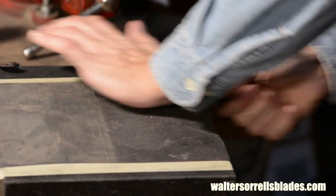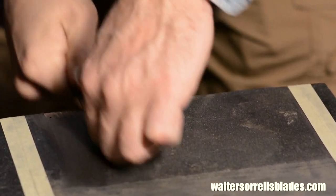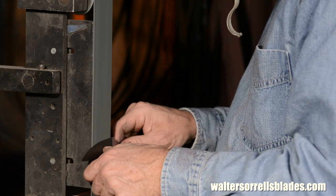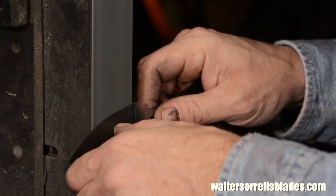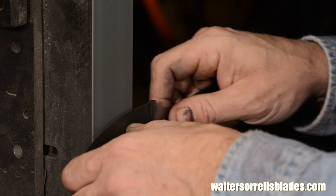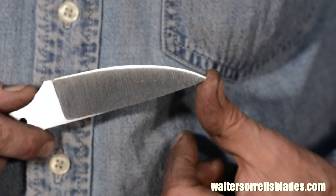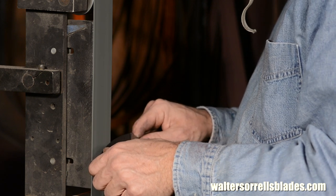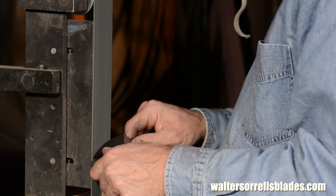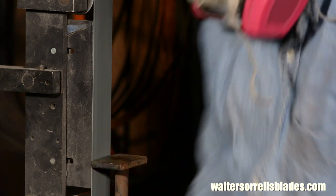So now I'll temper it for two one-hour cycles at 400 degrees. After heat treating, I'll clean up the tang with 320 grit sandpaper to remove the oxides that form on the steel during heat treating, then grind the edge to its final profile. Now be careful at this point — before heat treating you can get the blade so hot it turns blue, but after heat treating you'll ruin the temper of the blade if you let it overheat, and that'll make it so that the blade won't hold an edge. This blade is extremely thin, around six or seven thousandths of an inch, so the edge will just overheat in the blink of an eye. You've got to be very careful. I'm using 3M Trizac belts starting at 300 micron and working up to 65 micron. These belts are great for finish grinding because they run pretty cool, and they're also sort of forgiving in terms of geometry.